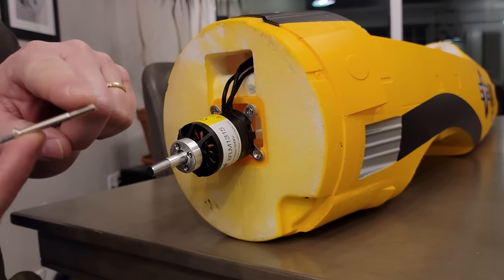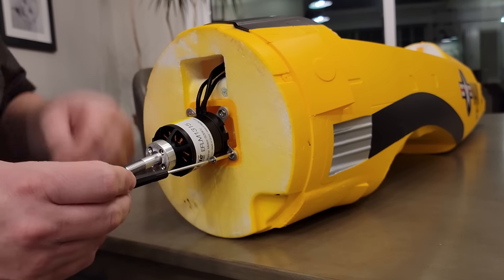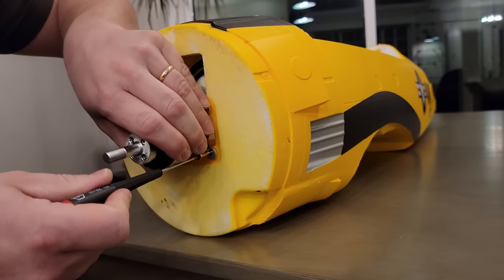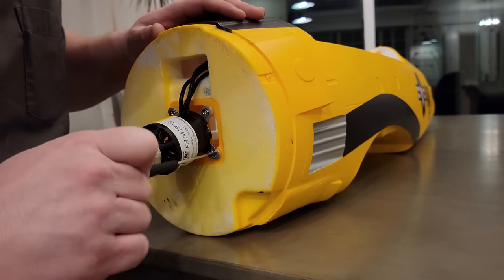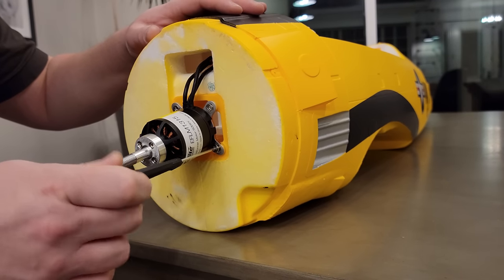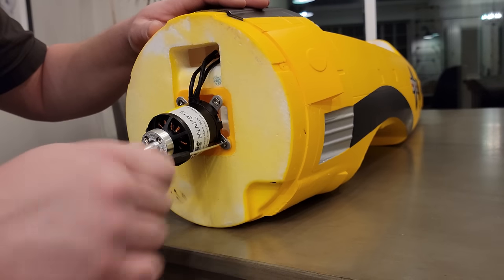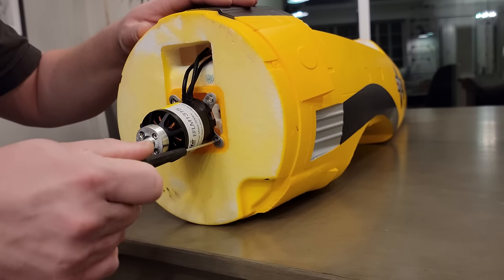can lubricate the tip of your screw with either some dry wax-based soap, like just soap from your bathtub or whatever, or you can use a little Dawn dish soap or dish detergent or a pump hand soap, and that stuff will help it to slide in. But it's not gonna compromise the integrity of your plastic. And no, you don't need Loctite on this.